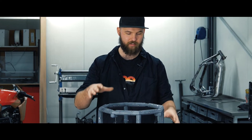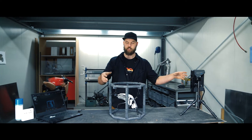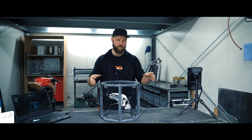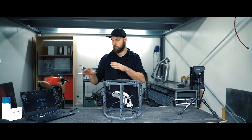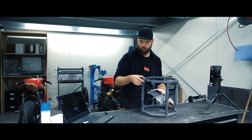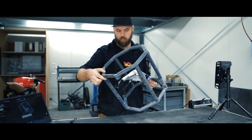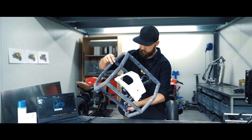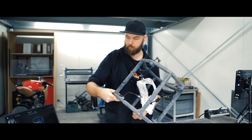We have it all set up in the fixture. My idea for how to use the target frame: you could either hold the target frame in one hand and the scanner in the other, but what I'd like to try is to have the scanner fixed on the tripod and just move the target frame around. That way you only have to focus on the target frame and what you're actually scanning, rather than managing everything at once. It's quite easy to just move the target frame around to get the scan — just make sure your hand isn't covering up all the markers.